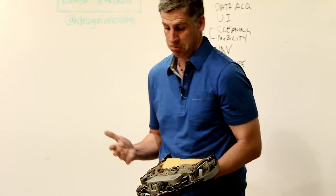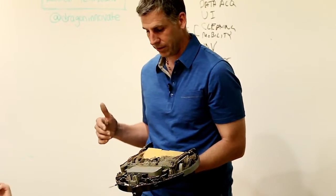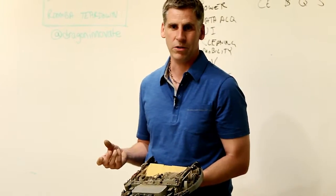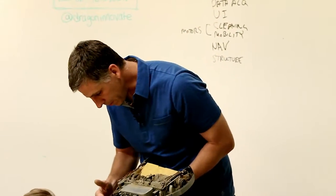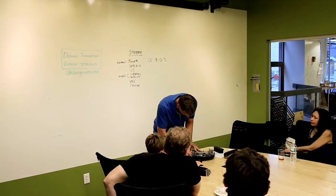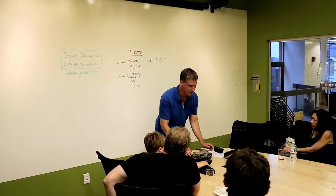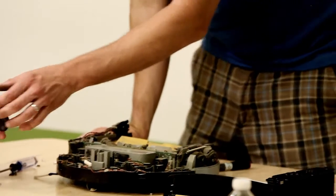When we did the math, we thought: why not use a mechanical switch? But the robot hits roughly six times a minute. Multiply that out to 1,000 hours and you're looking at 1 to 2 million bumper hits - very few affordable switches can handle that. So we used optical emitter-detector pairs, which don't wear out over time. Despite all the debris, they're self-clearing, with little holes to let debris clear so they don't get bogged down.